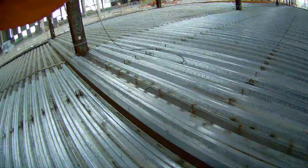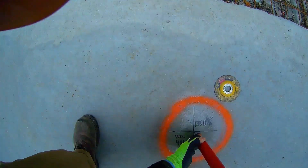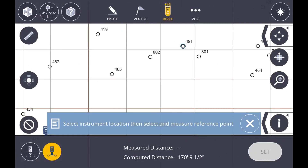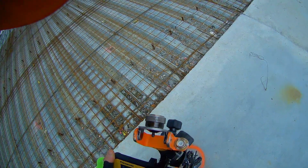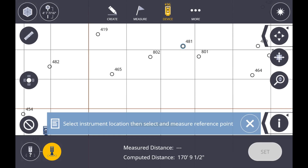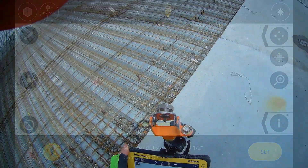I'm going to head over to our second known point to complete the check-in. I'm going to get the pole set up on here — it's number 481. I'll go into the map and choose number 481. The total station isn't pointed right at the prism so I'm going to use that button in the middle left side there and get the station locked onto my prism. Now I'm just getting plumbed up, prism pointed right at the total station, and when I'm ready I'll hit that trigger button in the top right corner. You can see the computed distance and the measured distance are exactly the same — that's a zero foot check-in.